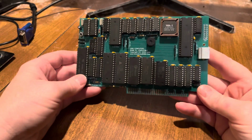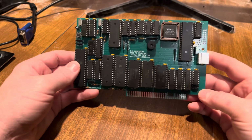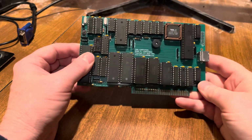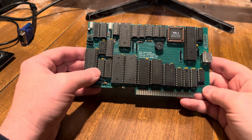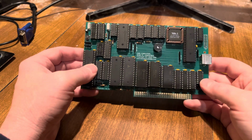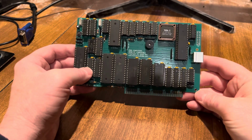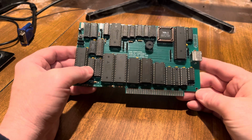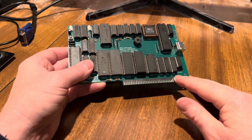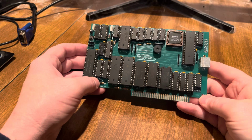But let me give a quick talk about this. It's compatible with an IBM 5150, not 100% compatible. Things like a PS2 keyboard socket there, a few other minor differences, but for the most part, it works the same as an IBM 5150. I moved it to the ISA card for cost reasons, because you don't have to buy all the card slots to solder into the board. You just need to buy a backplane, and they're pretty affordable.